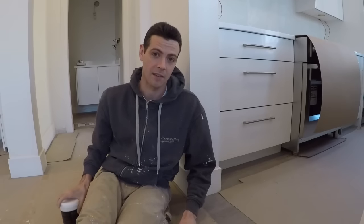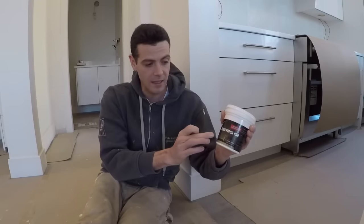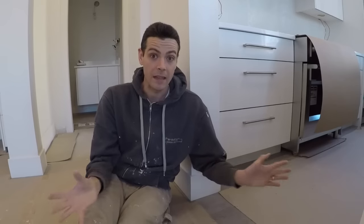Cutting at 46 degrees works pretty well and it's a pretty easy fix to make them look good once they're painted up. If you're doing stain grade trim, you blew it and should have figured out how to make those tight. But we are doing paint grade today. What I like to use for trim is Dynapatch or Elmer's wood filler — something like that. These dry nice and strong. Some people wipe caulking into an open joint, but I don't like that because it shrinks, and you can always see the coved-out space where the caulking has shrunk.